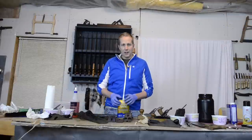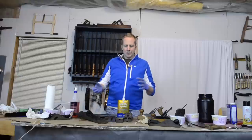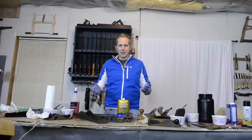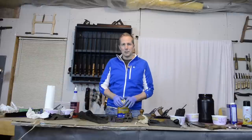There's a lot of rust on these old tools. I've tried a lot of things. I've tried electrolysis where you hook up car battery charger leads to the metal — that didn't work so well and it's kind of expensive and hard to set up. I've tried Evaporust and Crud Cutter, things like that — they're expensive and they kind of worked but really expensive. I've tried vinegar, it had some side effects, it was okay. But the best thing I've found by far has been making up a simple solution of citric acid with water.